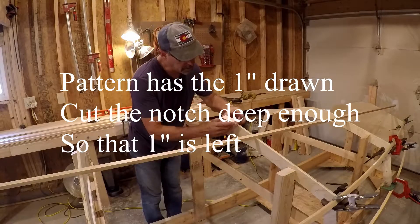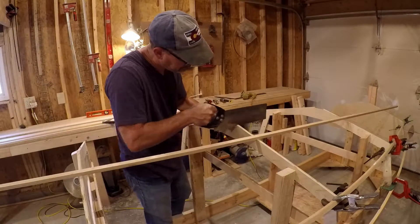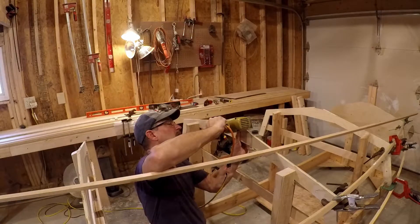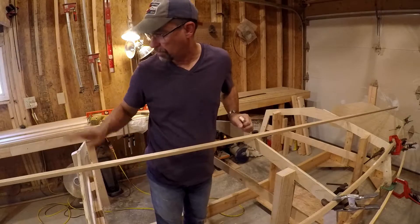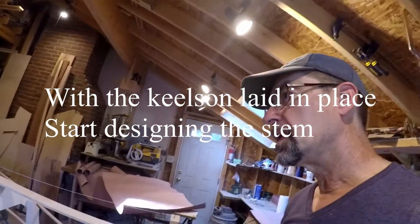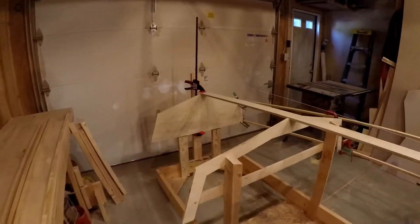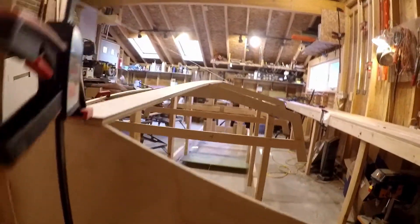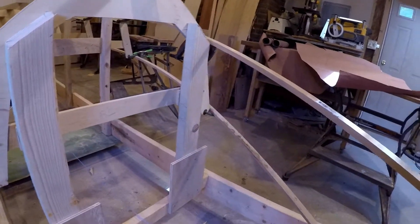Made a little pattern — it's the width, has the centerline marked. Using the ancient saber saw, leaned it up on R2 and R1. Got the keelson notched in and trimmed the excess off so it'll sit down. Got it clamped into place; the curve is looking pretty good. This now gives me the opportunity to draw out the shape of the stem.